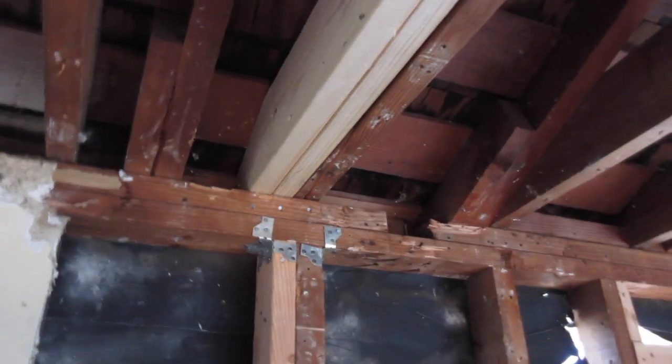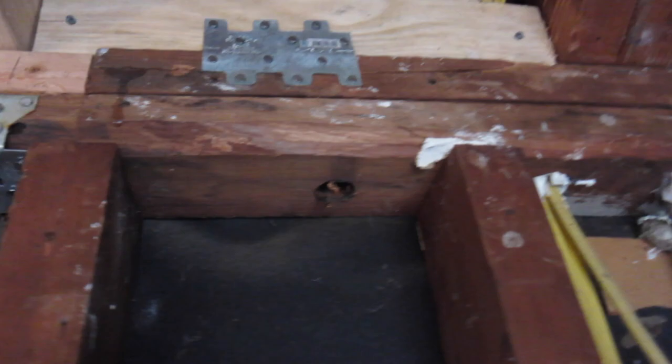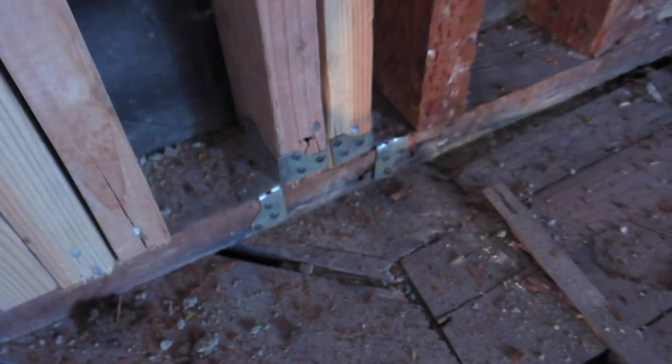So then they call out, since we don't have a bucket there, how we're going to fasten those. Okay, we're going to put a block between them and put a flat clip on there. Bingo, it's tied to the plate, it's tied to the beam, and then here's the new post. It's a double 2x4. I don't know why they don't just call out for 4x4s. Under a tripler, it could have been a 4x6, and then they say put these other Tico clips, A35s, high and low. So there you go. You got your little framing detail. You'll get details like this to compensate for situations where a standard issue saddle is not possible. On this one over here, you'll see later we'll put a post actually in the room.